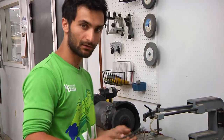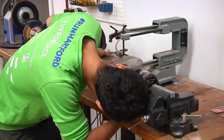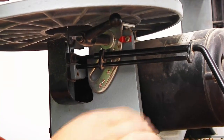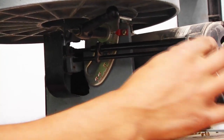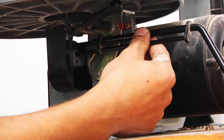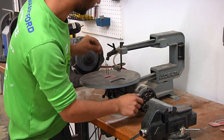So we're going to go down under here now to see how that works. The pin works best if you push down on the top so that it comes all the way down. The pin goes in the hole and then that lines the Allen key right up with the bolt. So then we can just loosen that and our blade comes right out.